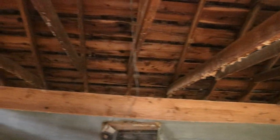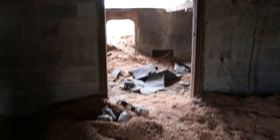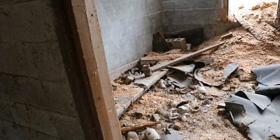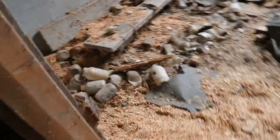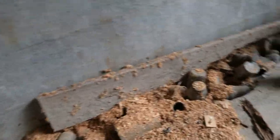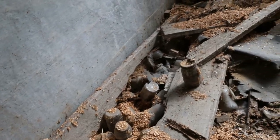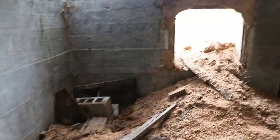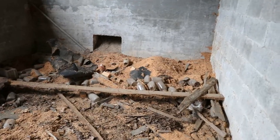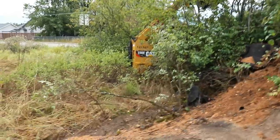It's going to be a little tricky in the beginning. We'll be sorting and separating wood and metal into different piles, then we'll go back in tearing out foundations and pulling concrete apart - breaking that concrete down into smaller chunks to fit more into a dump truck. We'll also be sorting concrete with rebar from concrete without rebar, as there are different pricing scales.